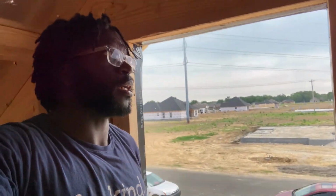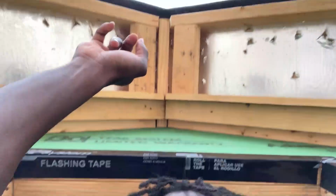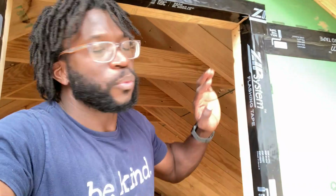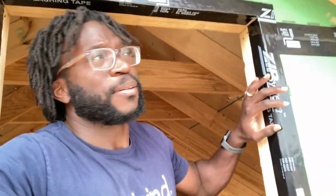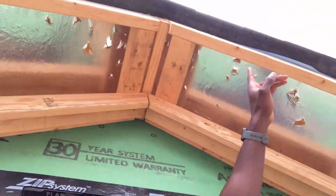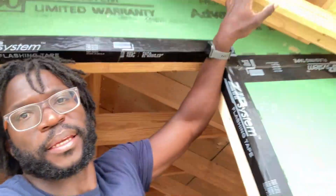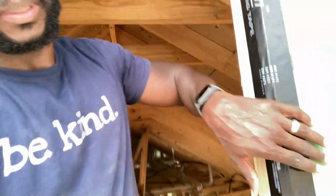First of all, moisture shouldn't get into this window, right? I mean, because you can see up above this window is kind of the edge or the ledge. They call this the rake. And so that's going to provide some shelter for this window. But in the event that you get sideways rain or something like that, you definitely want extra layers of protection. So that's protection level 1 here, the overhang from the roof. Then after the overhang, we have the brick that will go over this. All of this will get bricked.